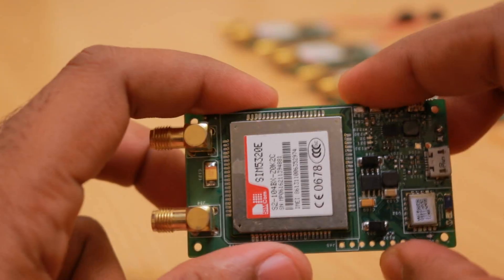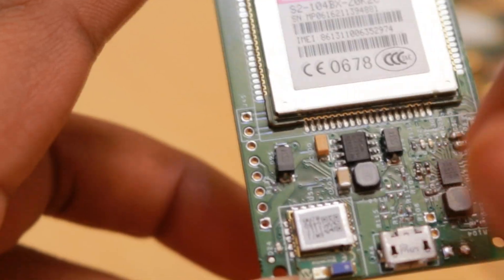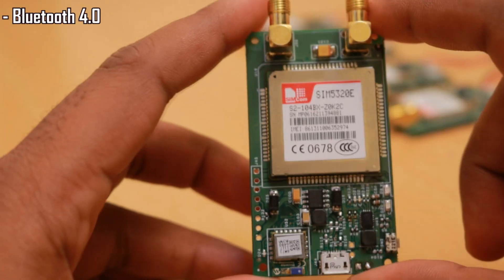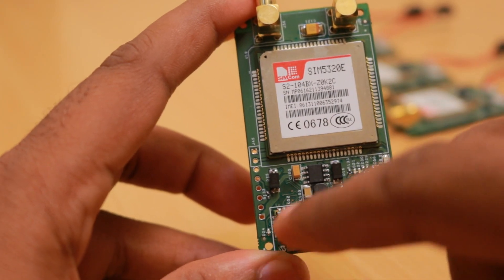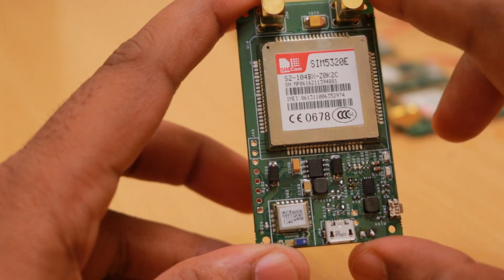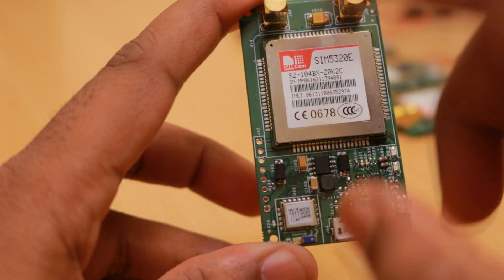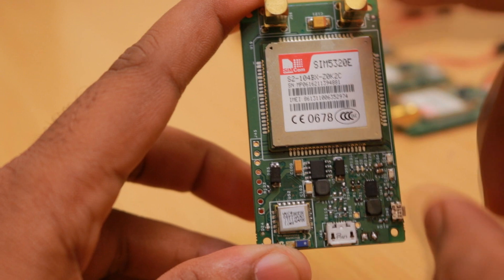This design is a variation of that design, and the major highlight is the addition of the Bluetooth module. This is a Bluetooth 4.0 module which is very useful for configuring the parameters of the device, because this module opens up a Bluetooth 4 transparent UART connection as soon as it is powered on. The microcontroller can directly send data on the UART port and that data will be received on the Android application.